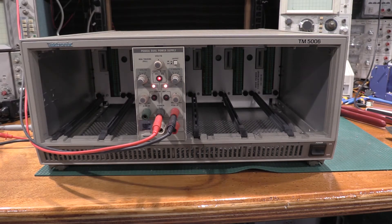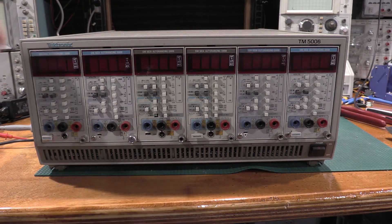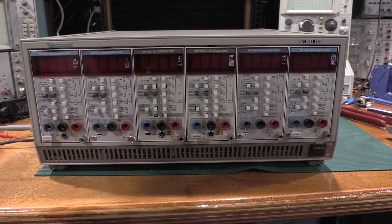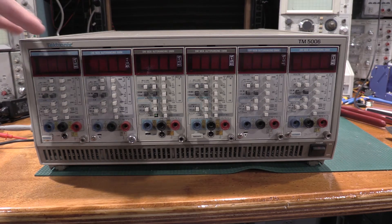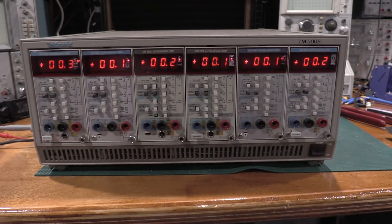This is my meter frame. I'll just get the volt meters, load them up, and let the power supply cook to make sure nothing happens. I have the frame loaded up with its meters again. Yes, this is mildly overkill. When I was working on scopes I had to work on multi-rail power supplies, so I was able to dedicate a meter per power rail to watch the whole supply as I was having everything burn in. This is six meters — they are calibrated. I went through the entire process from a previous video, so all six meters. Hopefully nothing smokes, and it powers back up.